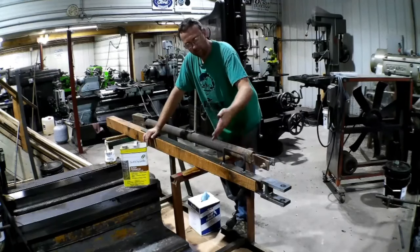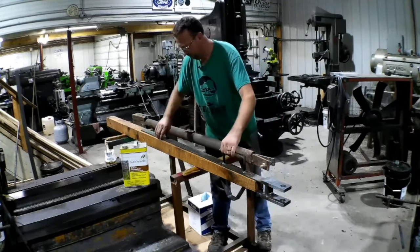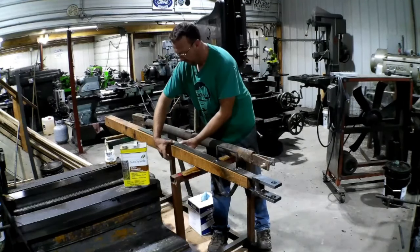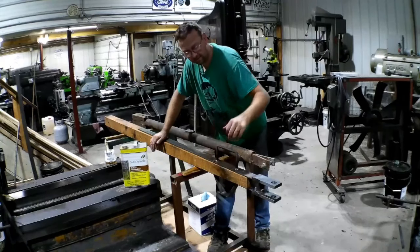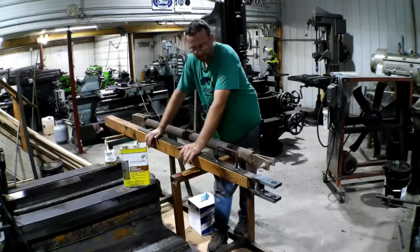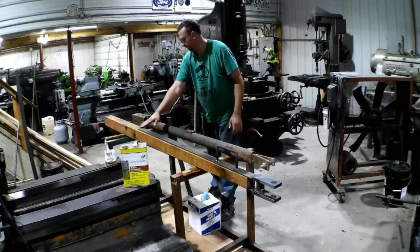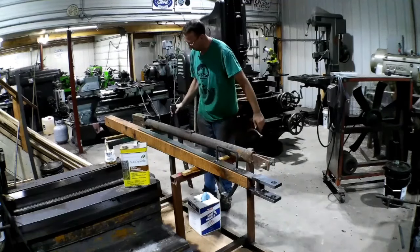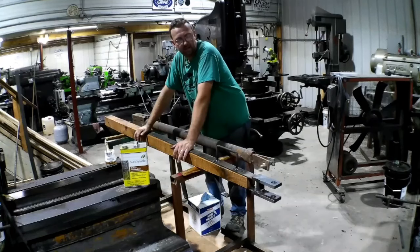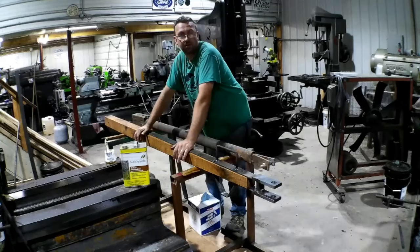What we were doing was building the tongue part. These two flat bars slide over the wooden tongue, then bolts through and get clamped on there — this is where we hitch the tractor. The piece I made underneath is for setting it on the ground for resting, and it doubles as a lift handle. With this piece coming back as far as it does, it overlaps the side braces, so if there's any weakness or any place that's going to break, it guards against that. You've got to remember, I'm hauling 300 gallons of water in that wagon, plus wood, accessories, the wagon itself, and up to two people — it's got a buckboard seat — so I want it as safe and strong as possible.